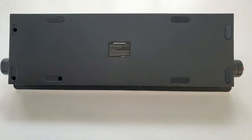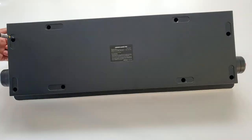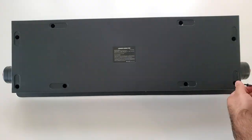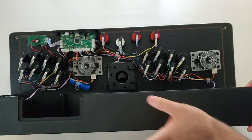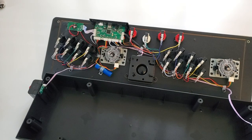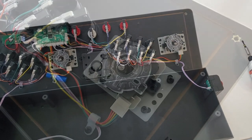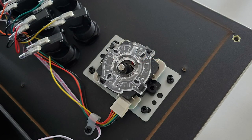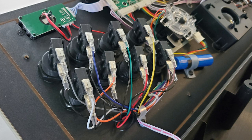Let's take this thing apart and show you what's under the hood. Disassembly is really easy — you pull off the eight rubber stoppers along the bottom to access the screws, then the base cover slides off. Be careful not to pull it too far as the pinball button PCBs are attached to the base cover. Inside there's a single controller board with onboard Bluetooth that connects to the puck. Everything else is wired into that control board — it's a really clean layout.